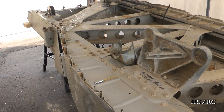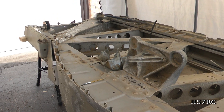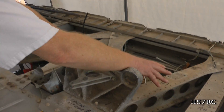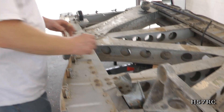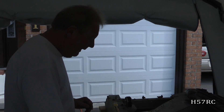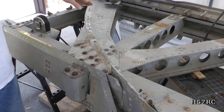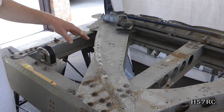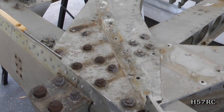As you can see, unfortunately it has been cut into three pieces. What I am doing right now is I've taken off this quadrant here so that I can get in and identify the parts, as well as another one over here. Here the part of the fuselage section has been removed again so that I can catalogue, inspect, and see how much corrosion damage there is — whether or not we have to make new parts or we can restore these parts.